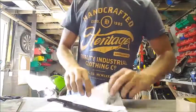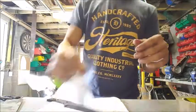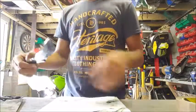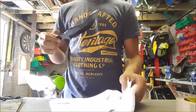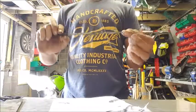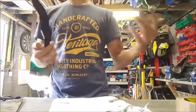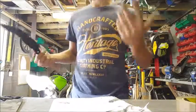than once. So we've basically got the hard bit out of the way now, making sure that a big old blade like this gets hard, because I only have a forge that is very weird when it comes to heating up large surfaces. You want to heat up a little bit, that's fine. My forge can definitely do that. It's why I like doing small knives, because they're very easy to heat treat. Big ones though, slightly harder to do unless you have some kind of kiln or PID control thing, because otherwise you have to keep moving it and it's very annoying to do.